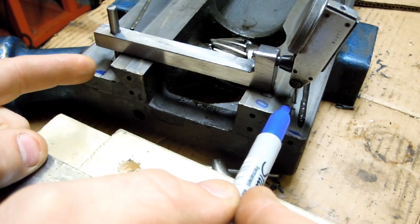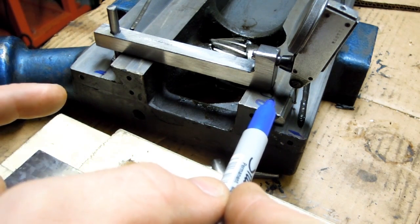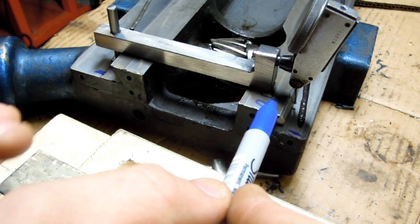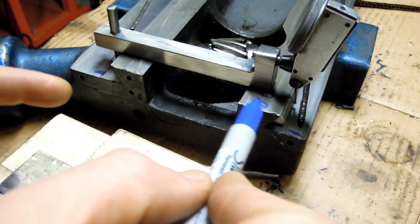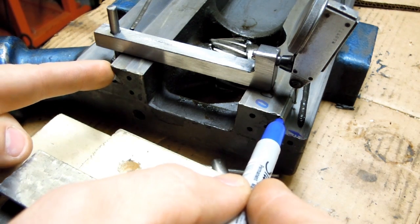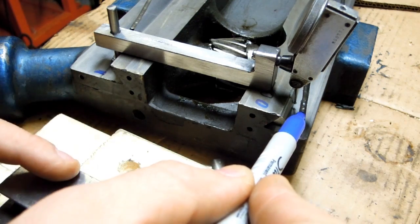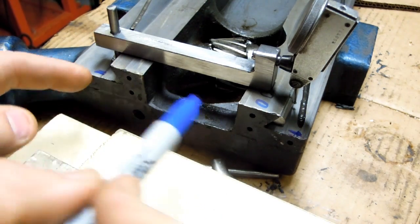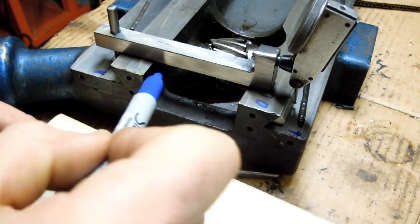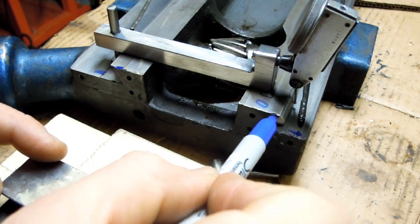I mean, that's quite significant. But again, at this point, I'm just trying to get a gross picture of where the wear has happened and what it looks like. Once these dovetails get machined in, I'll scrape the flat surfaces up against the master, which is the table here, and then repeat this measurement before I get into cutting the insides of these dovetail surfaces.